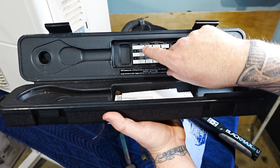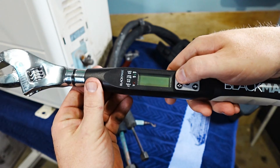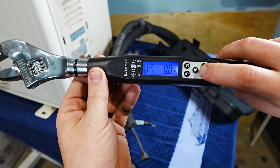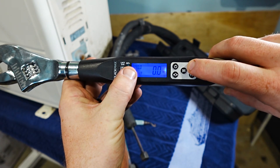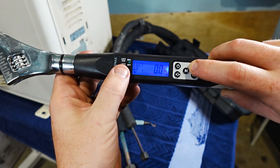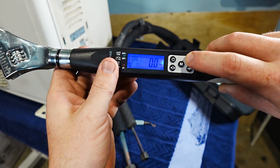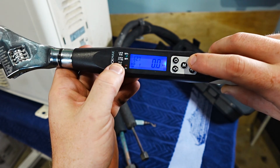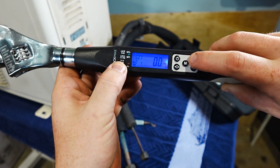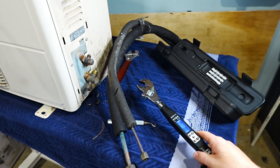I'm going to go by pound-foot of torque. For quarter-inch, I have 14 foot-pounds of torque, and for half-inch I'm at 40 foot-pounds of torque. Let me turn it on and show you what I mean. If I hit plus, I can scroll through the values — 48, 59, 62.7 — all the way back to 14. So I can use 14 for my quarter-inch and go to 40 for my half-inch. Let's start with the bottom one — we're going to do the bigger one first, then come back and set the small one.